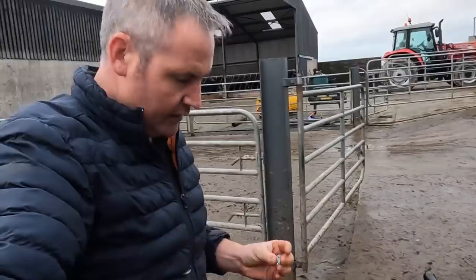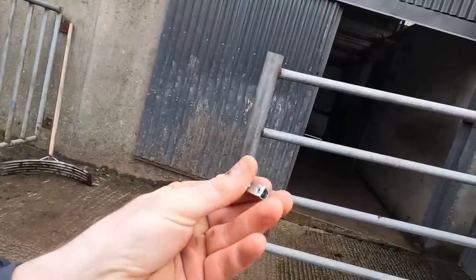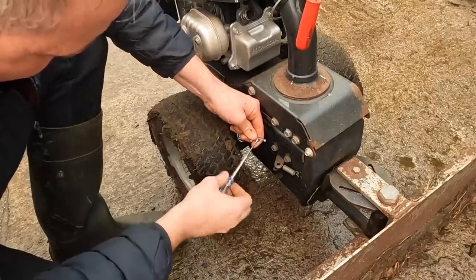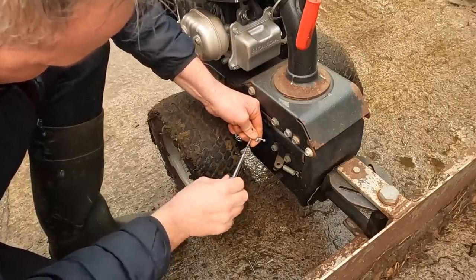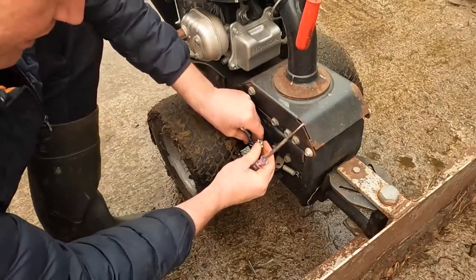I've devised a little bodge job. Look, we all do it, but unfortunately I'm having to do it quite a lot with this thing. What I've come up with is an ordinary block connector, the kind used in electrics. Cut off all the white plastic around it. Now I have a steel plate here with two screws in it. Tighten the two screws on the cable somewhere along the line. I shorten the screws, that way they don't contact the wire and there's no chance of piercing the wire. That'll move up and down on that cable, but it won't pull through the spring.